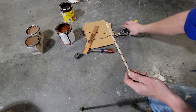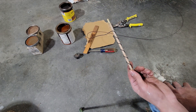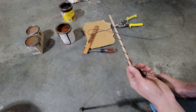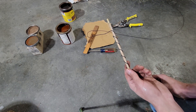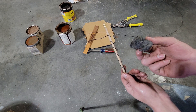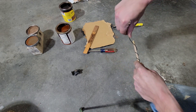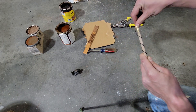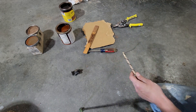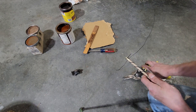I prepped the ramrod already — I sanded it with 150, 220, and 400 grit, then raised the grain twice, using the heat gun to dry it both times after wetting the grain. Then I just rubbed it down with some steel wool. I'm doing this as just kind of an extra effect on the ramrod, just wanting to show you how it's going to turn out.